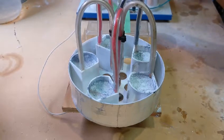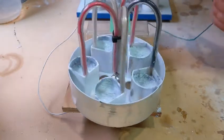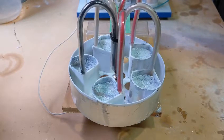You can see the flashovers here — that's probably somewhere around 30 to 40 kV in that neighborhood. This dielectric powder here is mostly titanium dioxide. So far I'm not seeing any motion here. I'll leave that one for now.